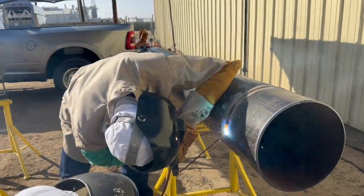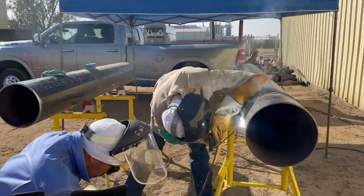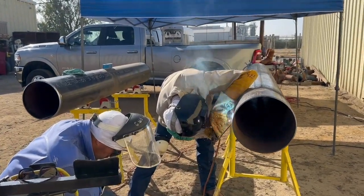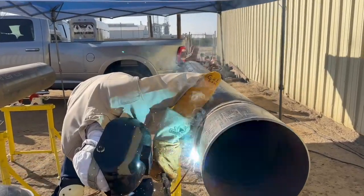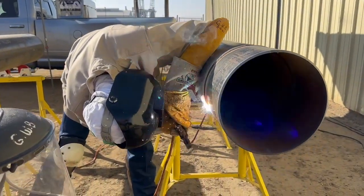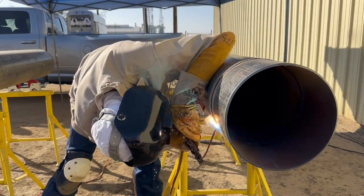You never want to go over the edges of your bevel. You want to be just a little bit below it where you can hang your fingernail on it. Then you want to run a strip down that side from about 2 o'clock to 4 o'clock to raise the center — so it's a little bit like the peak of a roof of a house. A little low by the bevel edges, and then the center needs to be flush or just a little above on the side, because that's where it flattens a lot.